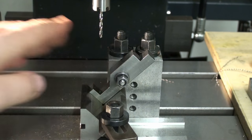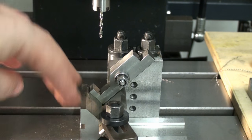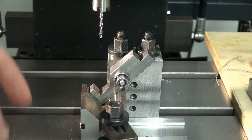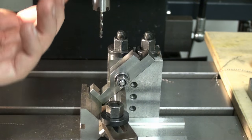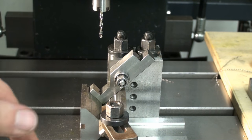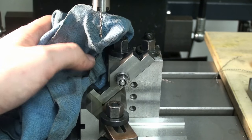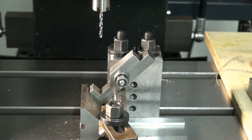I don't do it at work because I work on a fully enclosed CNC machine and I can only blow the chips against the guards in the machine. Of course, I also don't direct the air against the high-speed spindle in the machine because it has only labyrinth seals. But again, common sense. And in the home shop, holding a rag or your hand, which is bad practice of course, behind the air gun keeps the mess down to a minimum.